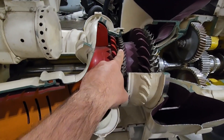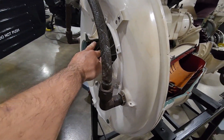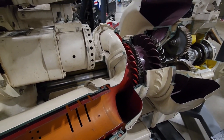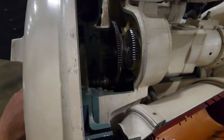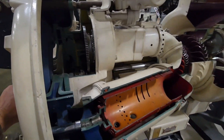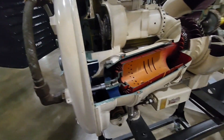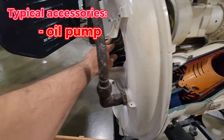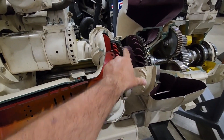From the stator, the hot gas goes to the turbine wheel — see how it spins. The turbine wheel is directly connected to the axial compressor; watch what happens when I spin the compressor — it's a one-to-one ratio. You also have an accessory box that spins and powers things like the oil pump, the generator, the fuel pump. You also need a way to spin it up first to give it initial RPM to light a fire. This whole assembly from axial compressor to turbine is called the N1.